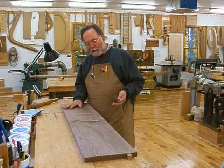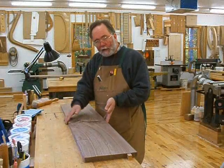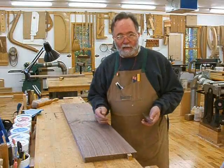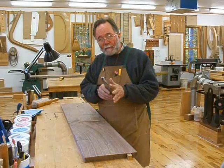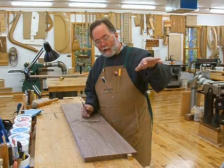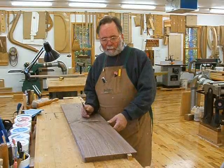Got my 2 planks cut to about 50 inches long and 10 1/4 inches wide. Later on I'll cut these into a little over 16-inch pieces, glue 3 of them together, and that will be one of my upright connectors between the top plank and the bottom plank of the mantle.